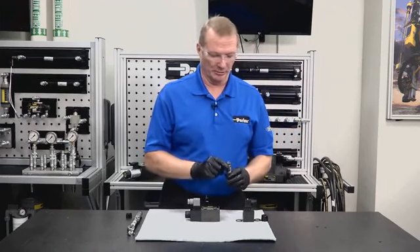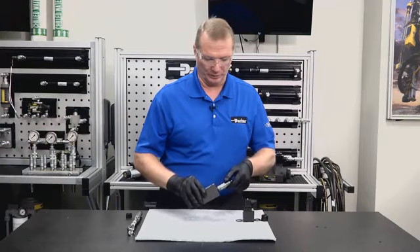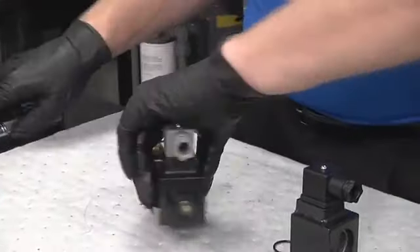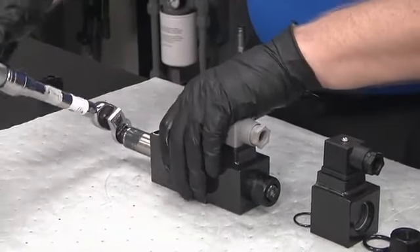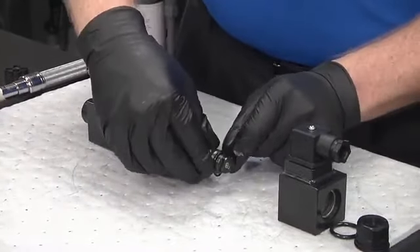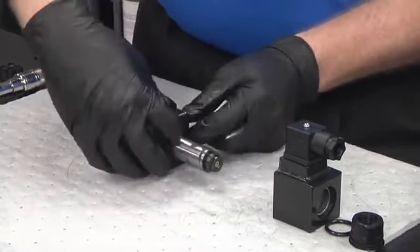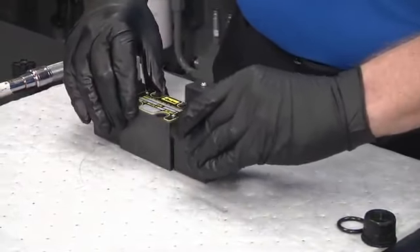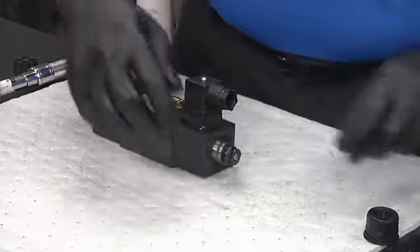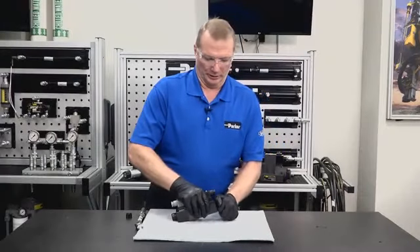On the other side of the valve, take the tube assembly — making sure the push rod, spring, and washer are in place against the spool — and run it in by hand. Torque it carefully to 180 inch-pounds, being careful not to damage the end of the tube. Install the inner o-ring up against the body, slide the coil assembly over the tube, and install the outer o-ring into the coil recess.